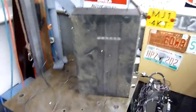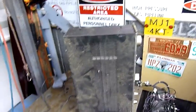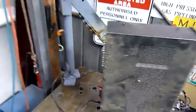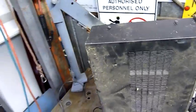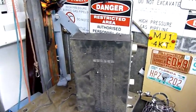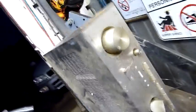Anyway, I'm going to get the cleaner out, cover off, all that sort of stuff, give it a really good clean up, and have a bit of a gander inside, see what's going on. I wonder if it's actually the same sort of problem that Terry's amp had, which was blown main DC capacitors. Who knows? It might work fine, actually.